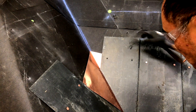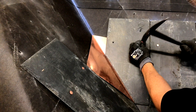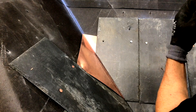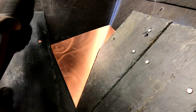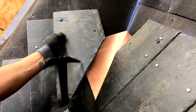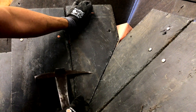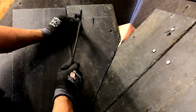The piece is cut and ready to install. He double-nails it on the side so that there aren't any holes in the center of the valley. The same thing on this side — punching in two nails on the left side so as not to nail the center of the valley. Then he puts in the next piece of copper.